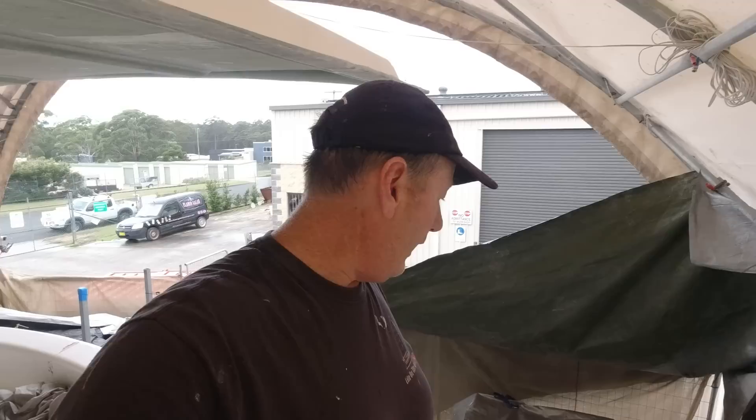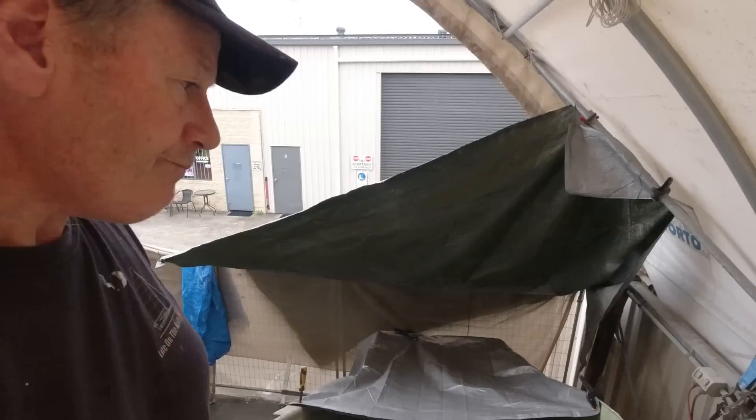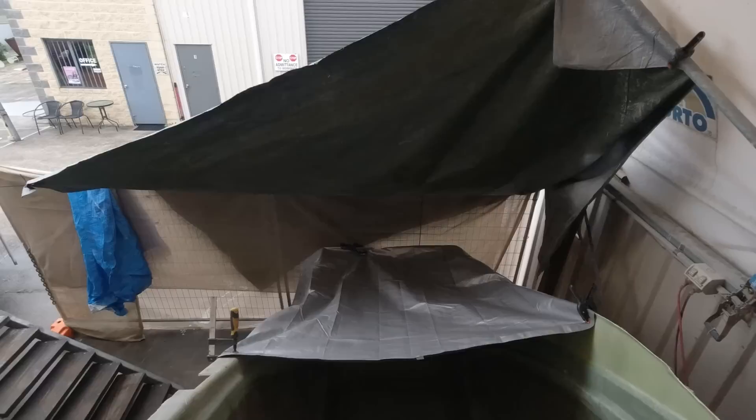I got myself prepared, sanded up, and all ready to go — and then Janet arrived and the second she arrived she brought the rain with her. So no laminating today, at least this morning, because the humidity is 100%. If I was in a factory under time pressure I'd probably carry ahead regardless, but I'm not going to stuff that laminate just for the sake of half a day's wait. I'll go and do something else — maybe head home and do some gardening because the place is looking a bit dishevelled with all the time we've been spending up here.